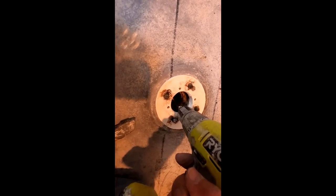So, cowboy spur, AKA inside pipe cutter. Run that down. This is 3 inches. Run that down about 2, just past the transition. You can cut it out from the inside. Then, oh, that's a horrible point. Hold on, folks.